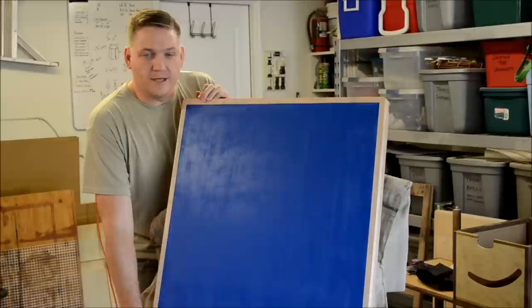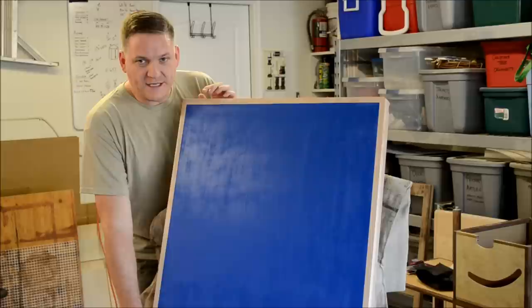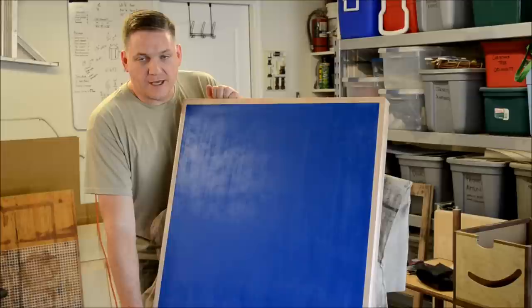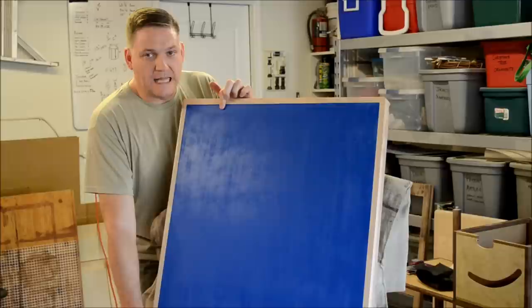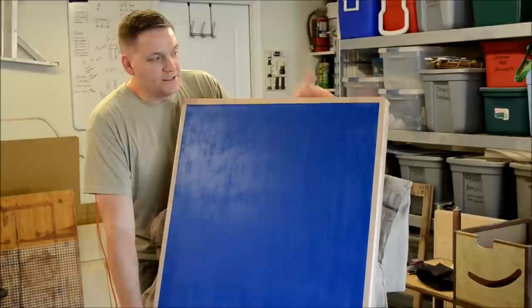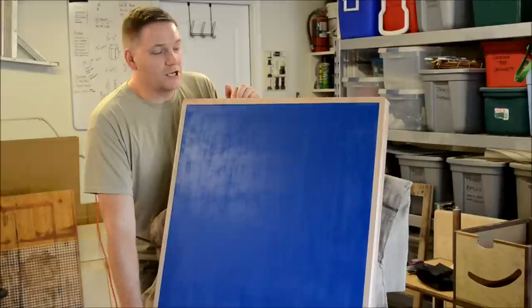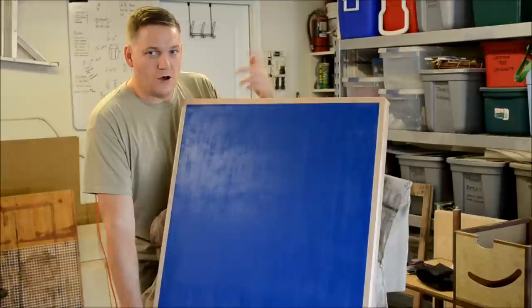This is the piece I'm going to spray polycrylic finish on with a spray gun, mostly just to show that it can be done. It's one of the wing tables for the table saw rebuild I'm doing on an old table saw. This is two pieces of three-quarter inch thick birch plywood glued together with a blue plastic laminate layer on top, and the entire thing is edged in hard maple. It already has three layers of polycrylic on it — the first two layers were done with a brush, with 220 grit sandpaper hand sanded in between coats on all surfaces.